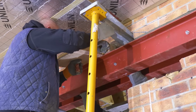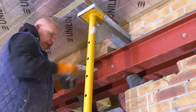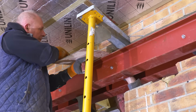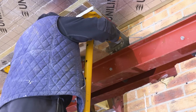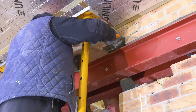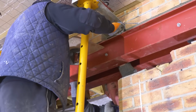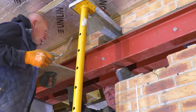Yeah. When you put those pad stones in, did you level them on a laser or what? The pads? No. I didn't, spirit level, because we were sort of slightly governed, because the lintel was still on. I had to put that one lower. Okay. Because we had cut this lintel. Yeah. It was slightly different. Did it work out though? Is it level? So it's actually just slightly off level, but yeah, we've got 2 plates under that one and 1 under this one. Oh, okay.